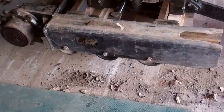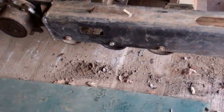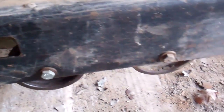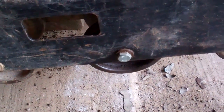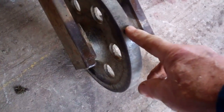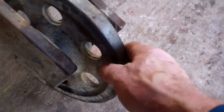I'm going to undo those three rollers at the bottom and check those out. They're filled with oil — each roller has sealed bearings in it and is filled with oil. It looks like this one's weeping a bit. This front idle wheel for the tracks has got sealed bearings in it and is filled with grease.